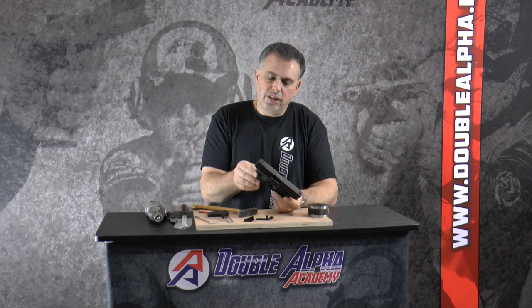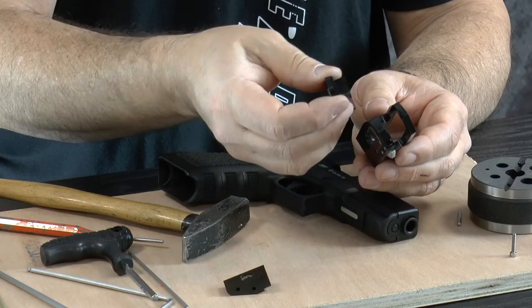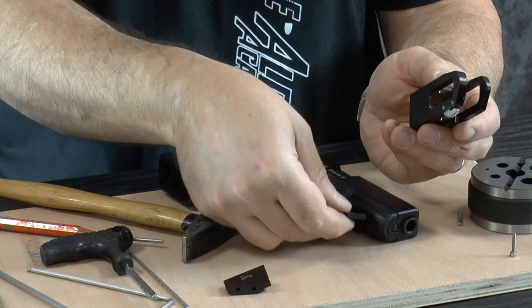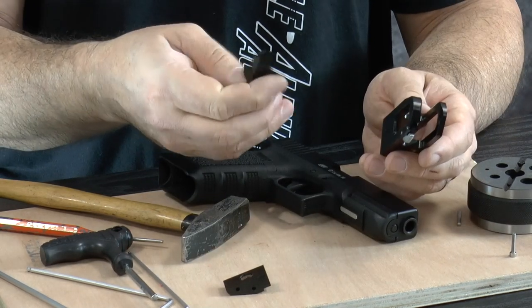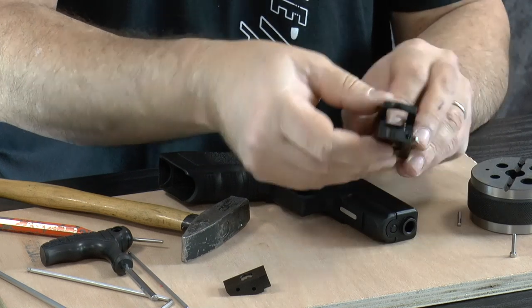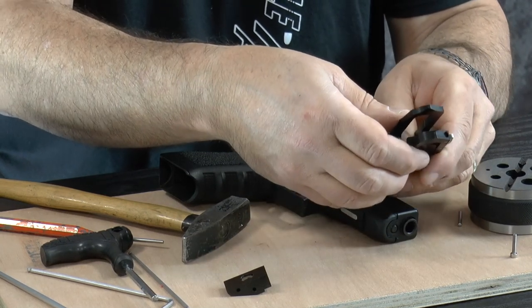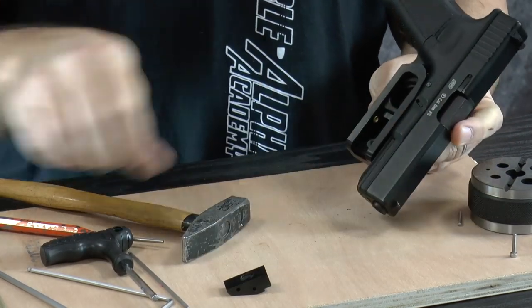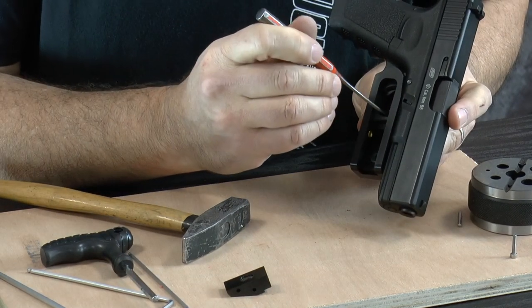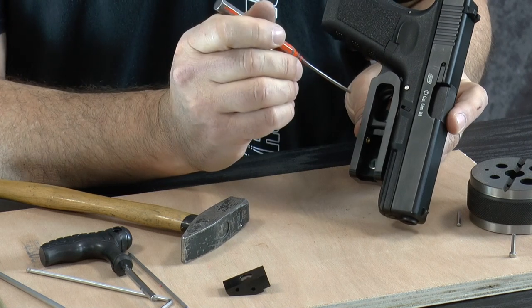Once you've achieved this loose fit, you can then address fitting the slide lock. The slide lock needs to be tested and fitted while in the block — there's no point holding it in your hand against the trigger guard because the angle and position may be different than how it functions in the block. Insert it, hold it in place with your finger or thumb, slide it upward, seat the gun in, and then take a close look to try and see where the contact with the trigger guard may be a little wrong or too tight.